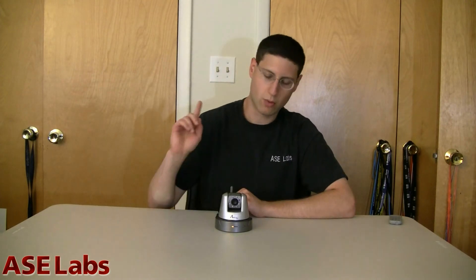The camera has a speaker port but it also has a microphone built into it. The microphone and the speaker are really useless for this kind of camera — it's a security camera. You really don't need to hear things; you really need to capture images. One thing I did forget to mention was the series of IR LEDs which will illuminate objects at night. So let's say you have this in a doorway at night — you don't want the camera to shine a big bright light on the subject, you just want to illuminate them so you can identify them if needed. You can also shut off the indicator LEDs to make the camera very incognito, so the person doesn't know you're actually looking at them. That's a nice feature that a lot of security people will probably like.